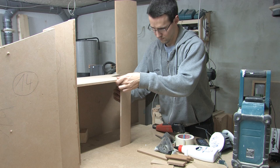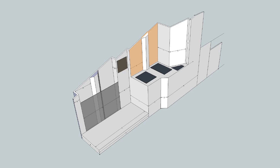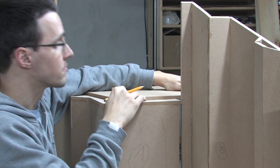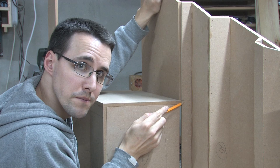I made another brace of 36 cm length to prevent the rear area from bending down. The top part of the table is a little bit longer to the back to give support to the following piece that sits on its top, so you have to cut a little notch into that small piece to close the gap.